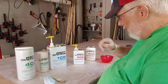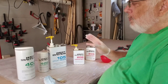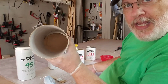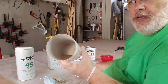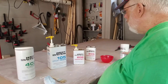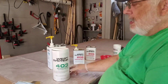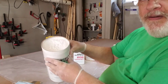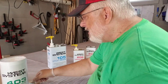The only problem I've had with West System is I found it a little thin to work with, until I realized they have additives. There are a lot of different ones. Initially I was using the 405 for making fillets and glue — you can see in there it's kind of the color of plywood; when you mix it up it comes out like a dark brown. That worked okay, but from doing research and speaking to West System — by the way, they have great customer support — I decided to get this one. This is number 403 microfibers. It's white, so when it mixes it's going to come out white, almost like watered-down Elmer's glue, and it seems to go a lot further.